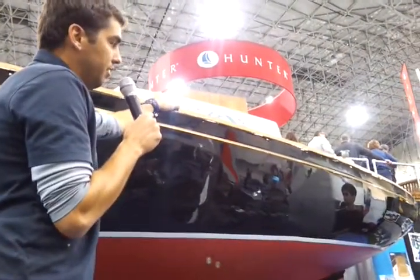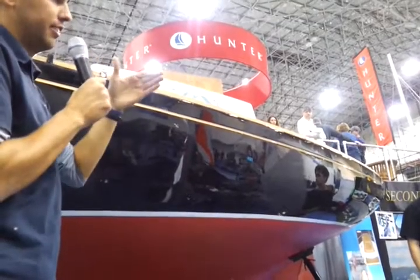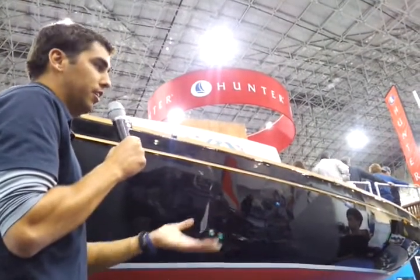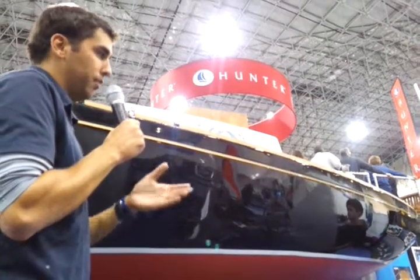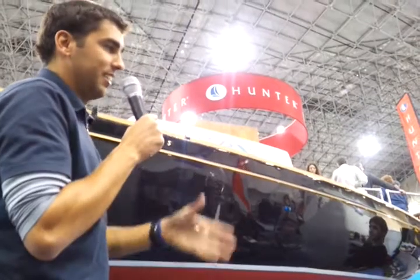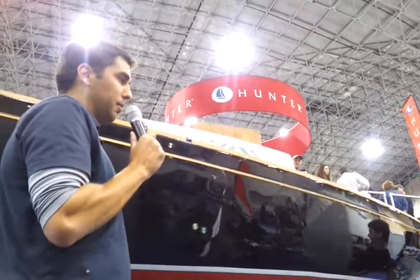As far as the non-skid, the non-skid areas don't suffer as much. They don't get the same abuse, just in being a shiny surface that doesn't oxidize as much. We don't recommend waxing decks because we don't want you to fall. I would say keep them clean, and if you have to, buff them every so often. But the non-skid is rarely the issue. People say, how do you get my nice eyebrow shiny, not how do you get the steps shiny. It's nice to get the vertical stuff, not the horizontal. Well, buff it and keep it clean.